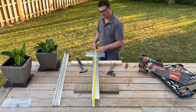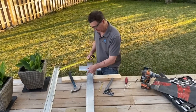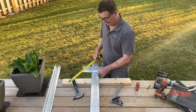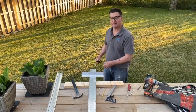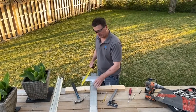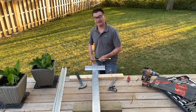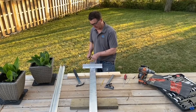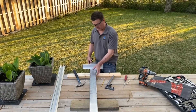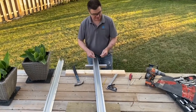This is an extreme case — it gives me about 48 to 50 inches from the top of the dock to the water. In many cases you don't need that much and can drill it down a little bit further. This would only give me about seven inches projecting above your dock. The key methodology is to precisely measure and get the holes mounted in the center of the flange.